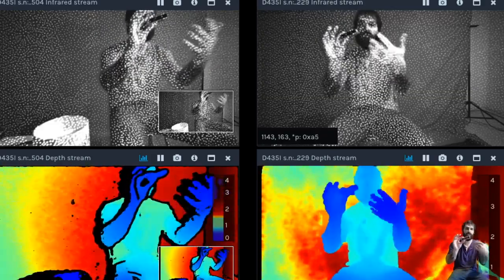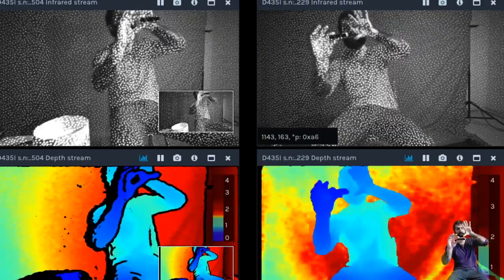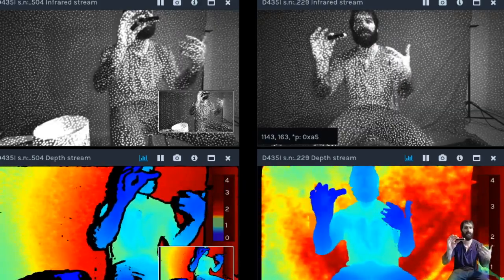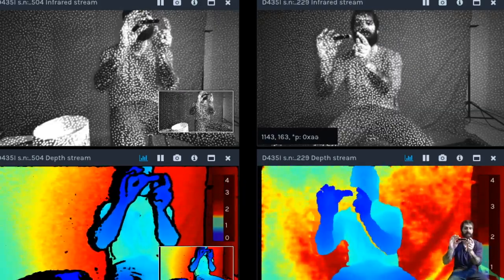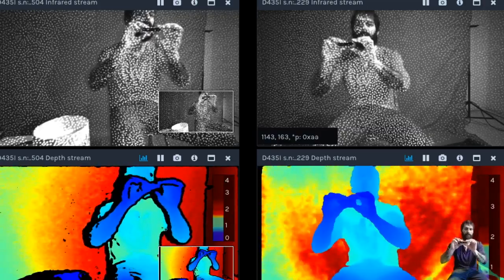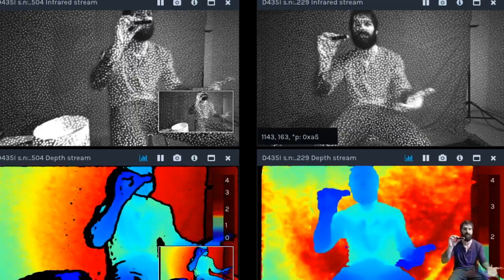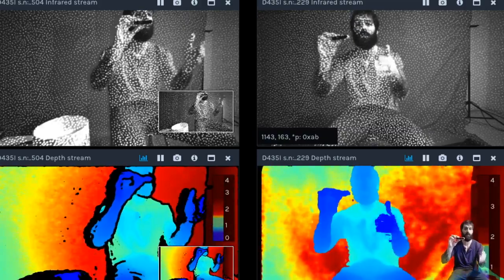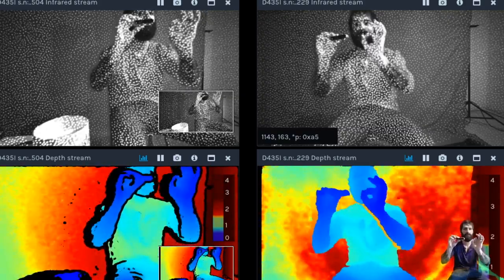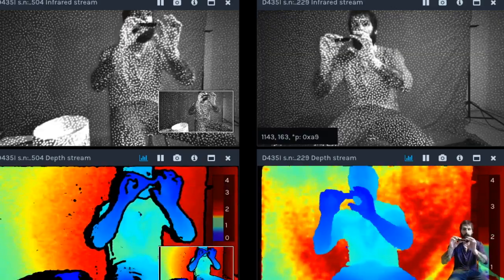This is very important in robotics and drones so it knows where it's at as it meshes all of this volumetric imagery together. As you can see here, the new infrared stream — they call this the vertical cavity surface emitting laser projector, or VCSEL — and you also have left and right side images for stereo vision, plus an RGB color sensor on the front. The resolution goes down to about 0.2 meters and can scan environments up to 10 meters wide at 1280 by 720 at up to 90 frames per second. I'm only running this at 30 fps, but the Intel sensor utilizes a 28-nanometer Intel D4 vision processor for the depth data and a RealTek color image processor.